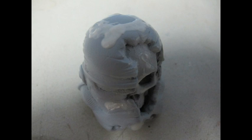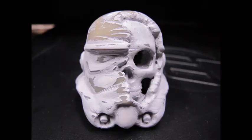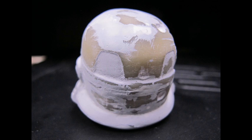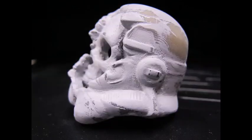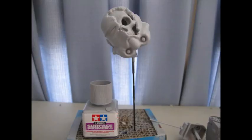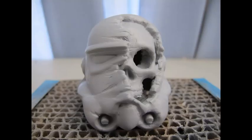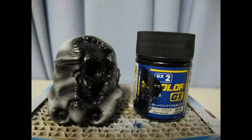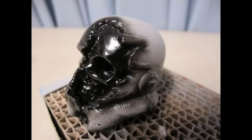I scraped the fairly solid yet brittle model off with a scraper from the supports, then washed and submerged the whole model in methylated spirits twice to get as much of the fresh resin residue off as possible — you shouldn't be handling it with your bare hands, as it's irritable and not healthy for your skin and eyes. I cut all the supports off with plastic nippers, drilled holes at the bottom, re-washed and drained any resin stuck inside. I washed the entire model under water to remove any chemical residue from the methylated spirits, then allowed it to air dry for quite a few hours.